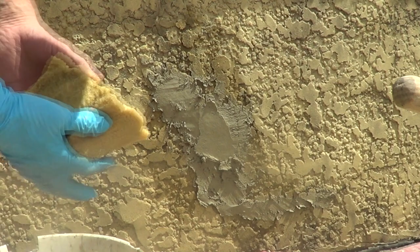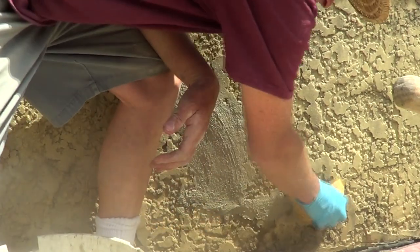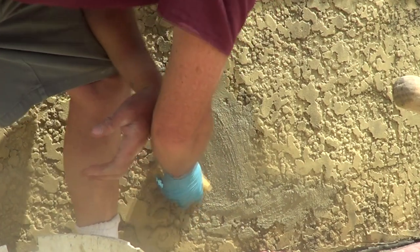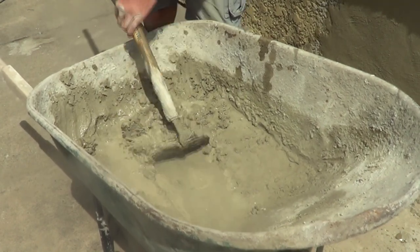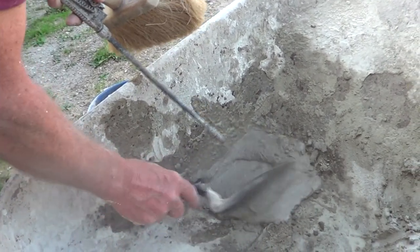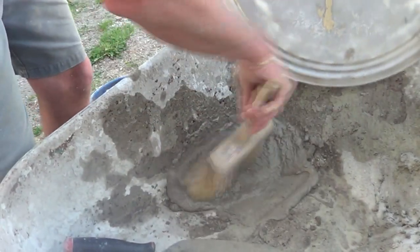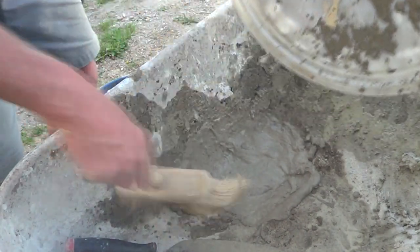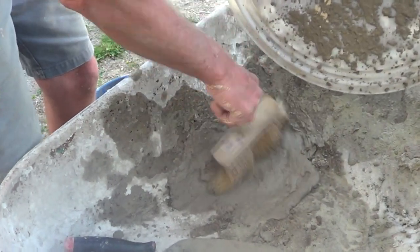Get the sponge, go over it — that's all, it's stucco. We're going to splash it, make it rough a little bit. Then we're going to make this a little bit soupier. You've got to practice with it — that's why I'm going to do this just on the side to show. Then you get your brush. The old timers used to use sticks. Get yourself a piece of plywood or something, stick the brush in there, and practice. See that? Sometimes you've got to wait until it's a little thicker. That's how you do stucco — practice before you do something, on your steps first.